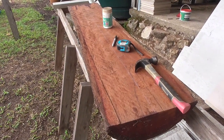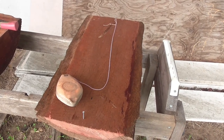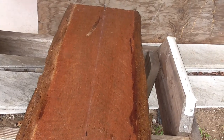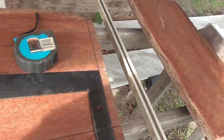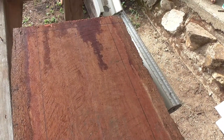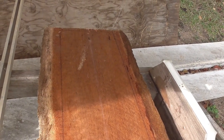This is the timber I've got to build the shave horse out of. As you can see, it's a flitch off the side of a log that I had saw-milled. This is another piece of it here. One of the first things I want to do is establish a centre line — or roughly a centre line — nice and straight to work off. I've got my chalk line on here and I'll just lift it up and ping it. Now that I've got centre lines established on both bits of wood, I'll mark out where I'm actually going to cut with the marking pen. You can see I've drawn lines for where the end is square, and where I have to cut square again on the end. This wide part here will be the seat, and this other little part forms the piece of wood that the work sits on.